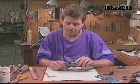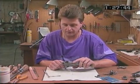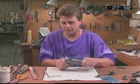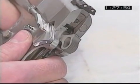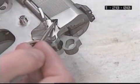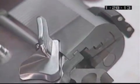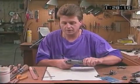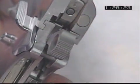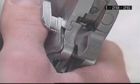Now, the other thing you need to watch out for is that a lot of times if you put a match barrel in a gun, you'll end up with your slide sometimes sitting further back than it originally did. This notch here has to clear your safety. Now this one has quite a bit of clearance. You want to have at least 25 to 35 thousandths clearance. That gives you a little bit of movement. That way, if your gun gets real dirty, or while you're shooting it happens to be sitting maybe not closed all the way, you can still get your safety up so your gun will be safe.